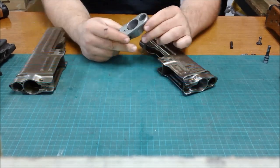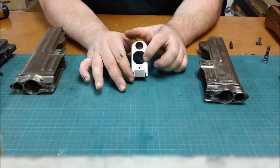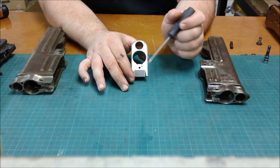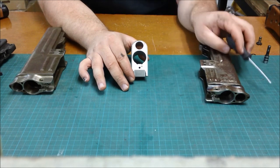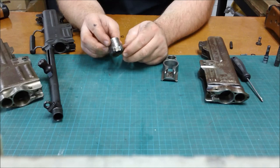Here is actually the barrel trunnion. It's going to be very interesting. Remember, this is a rifle from the 60s and 70s. Right there, M4 cuts. Feed ramp cuts on the barrel trunnion, just like you have in an M4. We have a very old barrel extension of his.